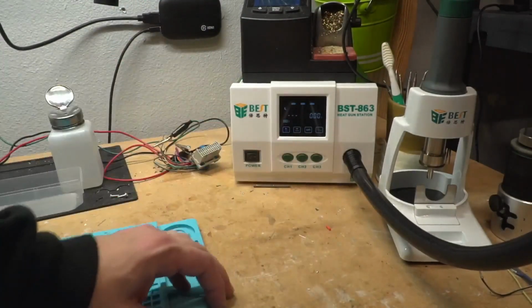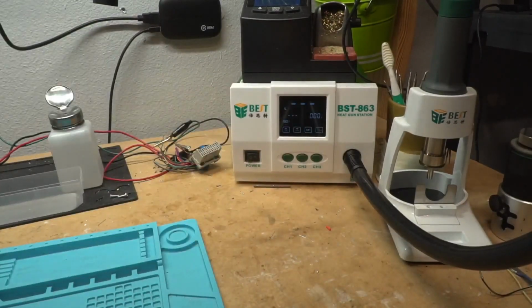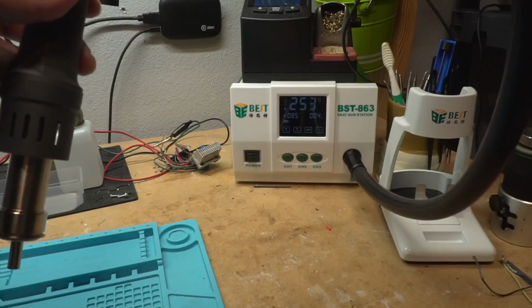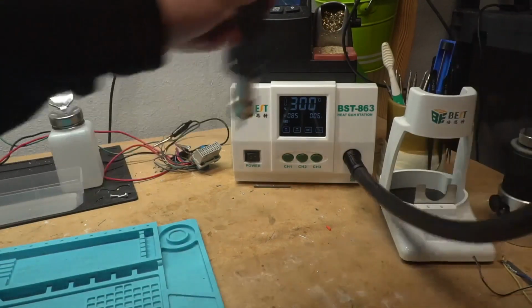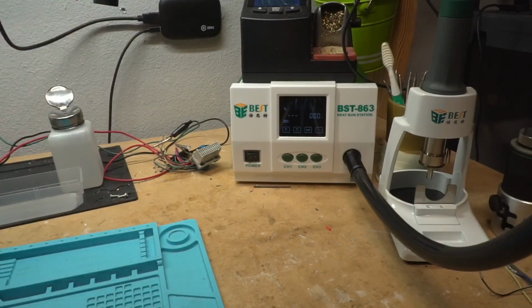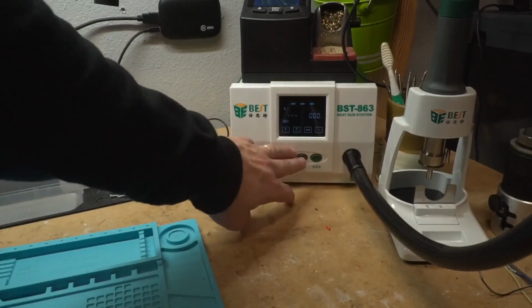It's got this really nice touchscreen on here. The user interface is super easy to use. It's got a Hall effect sensor in here, so that way when you take it out, it goes, and it heats up super fast. So it took 5 seconds to get to 330 degrees there, or 300 degrees. I wasn't paying attention. So that would have been my channel 3 setting there, I believe. But yeah, super fast to heat up. User interface is super easy to use.